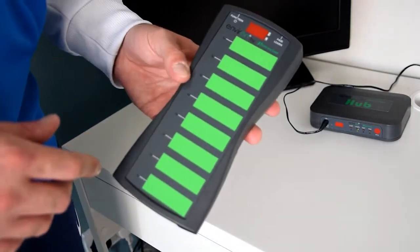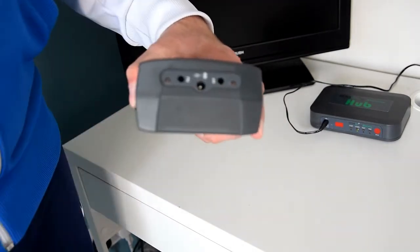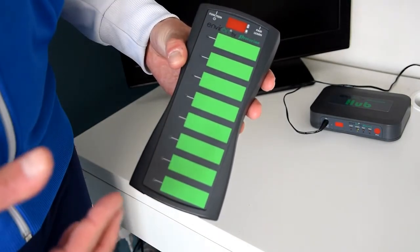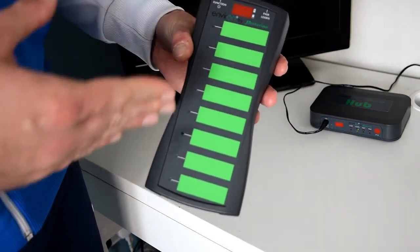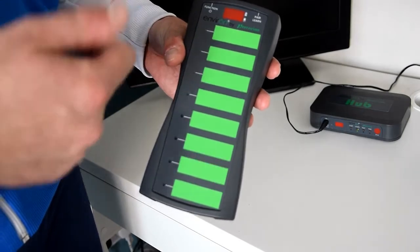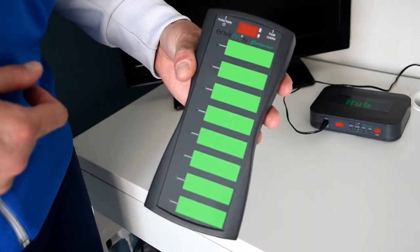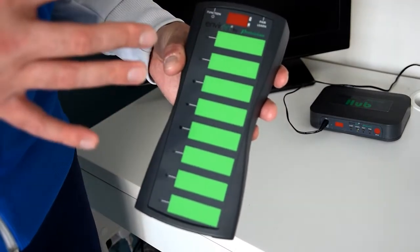It also has a scanning mode, so it's called a scanning remote for that reason. It has 2 inputs at the top here. Those 2 inputs are 3.5mm jacks for wired switches, and those switches can scan across the different buttons and access it in all the different scanning modes you're aware of using. So single switch scanning, where it auto scans and then you press when you're through to the button that you'd like. You can also set up a dwell scan, so you can press the switch to move between the different buttons, and then after a certain period of time it'll automatically press the button. And you can have 2 switch scanning, so obviously one can scan across the different buttons and one can action that button. All of these features within the learn mode are adaptable for times and speeds as well, so that's worth noting before we go in and show you how that looks.